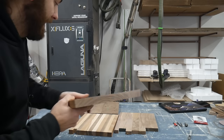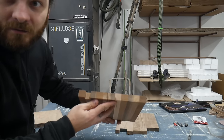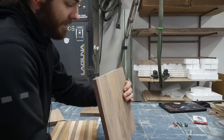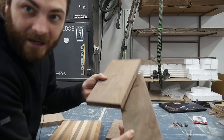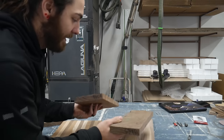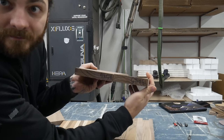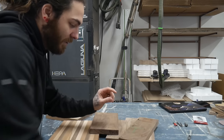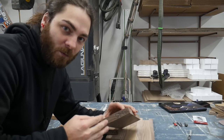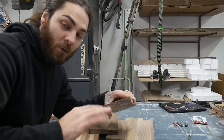So how do you combat that? You combat it by gluing the board together in a bunch of little strips. If it's the same type of wood, even better. Or take two large pieces of scrap and glue them together in opposing ring directions. Also, if you make them super thin, the odds of warping are a lot higher, so I generally like to make mine between three-quarters and one inch.